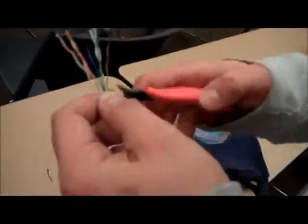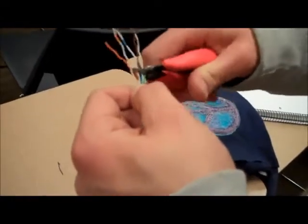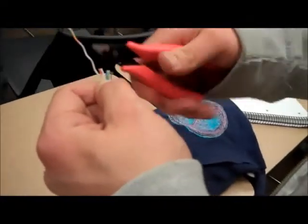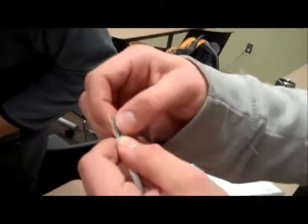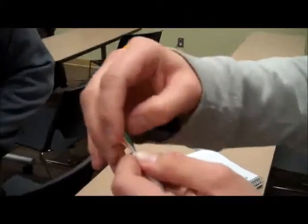Once I appear to have them in the order, I'm going to go ahead and grab a snipping tool and snip away to make them smaller so I can terminate them in an RJ45 connector. When I get them all snipped, I check to see if snipping them got them out of order and I try to straighten them a little bit more so they're easier to terminate. I'm checking for evenness, like a haircut. When I see that a couple of wires are a little longer, I try to snip the excess off, and then I continue to make sure they're in the right order.